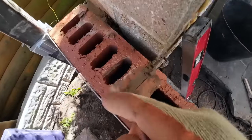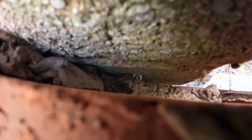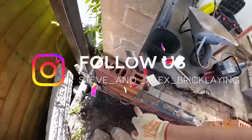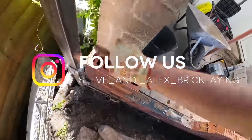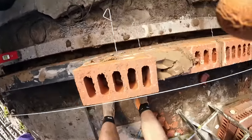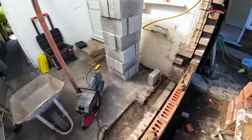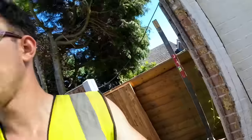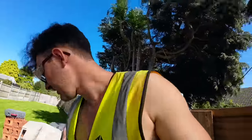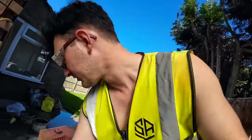There's still screw ties going in. You can just about see the plug. So the screw ties are going in every 3/4, alternating between this side and that side every so often. And then your standard every 3 for the opening, every 6 for the regular. So before you come attacking me for the tie wires, I know what I'm doing. Okay? I know what I'm doing.